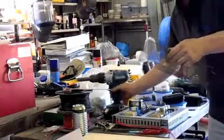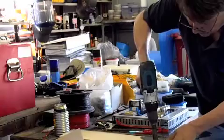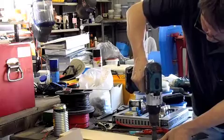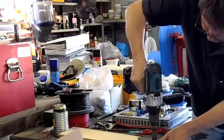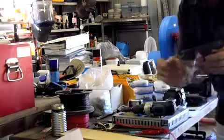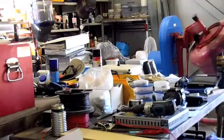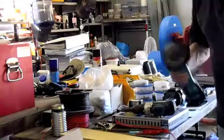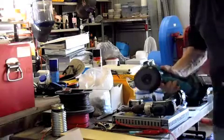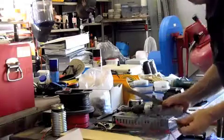Simply take your hole saw and very carefully, because perspex is quite brittle, drill the corners out. Now we have the corner drilled out, we simply need to cut these and straighten up the edges. Use a hacksaw blade very carefully, or if you can afford one, a nice thin cutting blade on a cordless grinder. And just finish it off with a file.